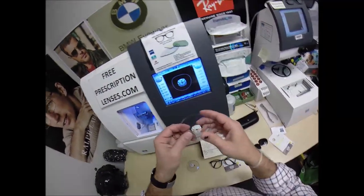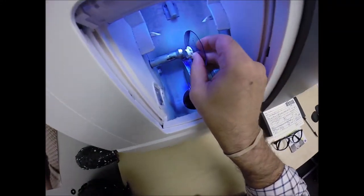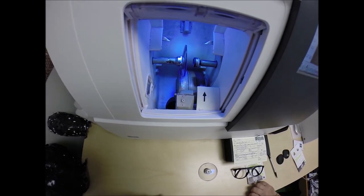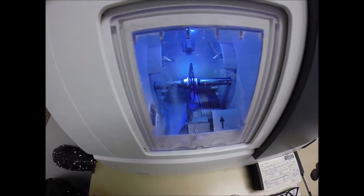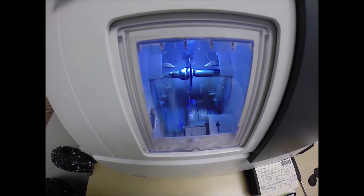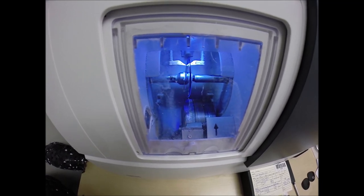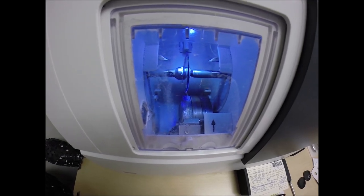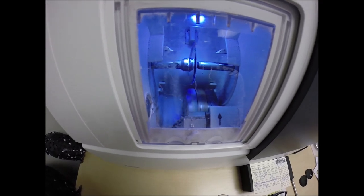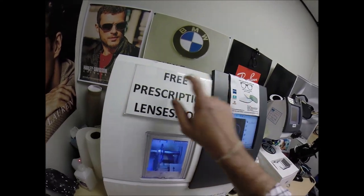Let me grab the right lens. I'm going to press the sticker on firmly, place the magnet into the chuck — or as I like to call it, the Charles, because I just don't know this machine well enough to call it chuck. I'm going to hit the green start button, the door closes. The lens is going to be traced by two white styluses, making sure it's large enough to fit into the right side of the frame, then measuring the thickness of the lens to make sure where to place the bevel so you have the least amount of edge thickness showing.